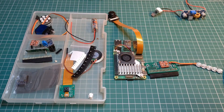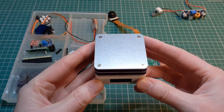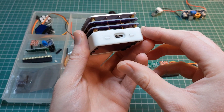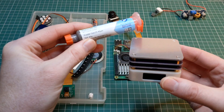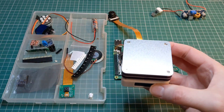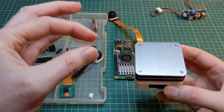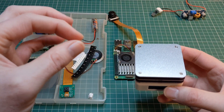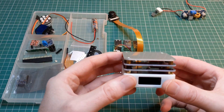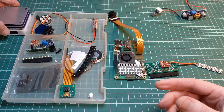There are a few different ways you can heat it. One of the ways I'm going to try this time is to use one of these heat pads. The way this works is you plug it into a 20-volt USB-C power supply and allow it to heat up to a specific temperature that is hotter than the melting point of the solder paste. At that point all of the components sat on top of the paste should reorient themselves as the solder melts, and all you need to do is make sure they've aligned correctly. I'm going to give that a go because I haven't done this before, but in theory it should be okay.